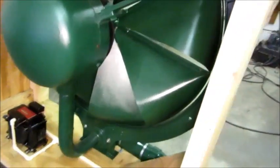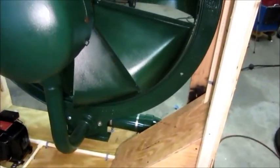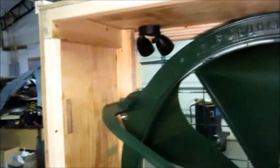That click at the end is when the main power transformer's contactor turns it off. With the cord mounted there and a strain relief, the little water pipe conduit comes in, goes back here, tees off for the transformer, comes up here for the low voltage side and underneath the cover, and then comes out up to the control panel. Really no exposed wiring — it all looks very simple and doesn't detract attention away from the fan itself, which is my goal after all for this whole build.